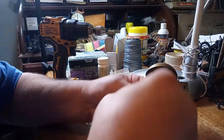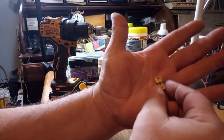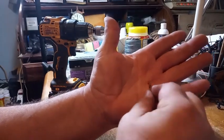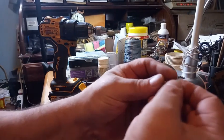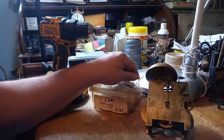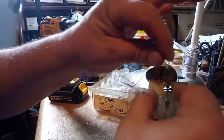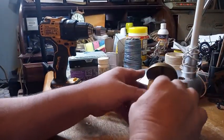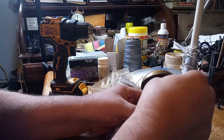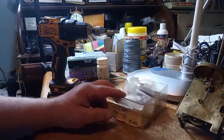So I bought a bunch of suspension springs off of Etsy — a seller over in England — and I bought a hundred for like $50. Except these already have the pins in them, so they will not work for this particular clock. You need one similar to this that has a pin for the pendulum and then a hole, so you can stick it in this suspension spring shaft. But then you have to have a tapered pin to put in there, and my tapered pins don't fit.